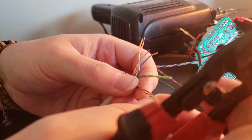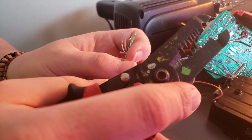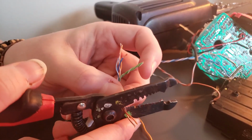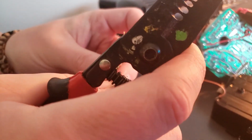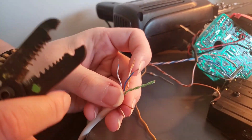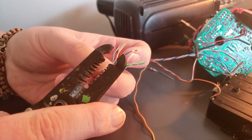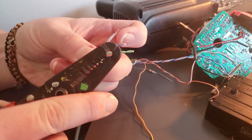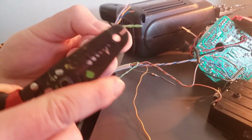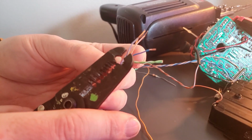Alright, so we have the master on and off switch put on, and for the time being, this is not going to be able to turn on without this being put on. So what we're going to do is we're going to cut this a bit shorter, and the reason we are cutting this shorter is because we do have these open wire glitches, and the last thing we want is for these to actually tag onto these, because they're not meant to have the entire battery power put into the circuit board on that specific place, so that's just asking for the Furby to get fried.